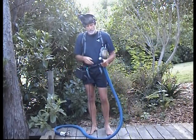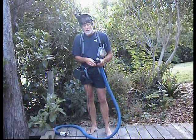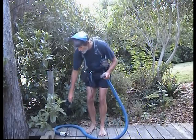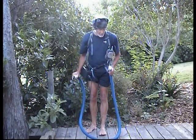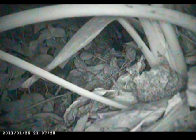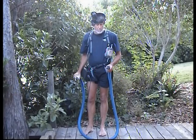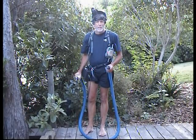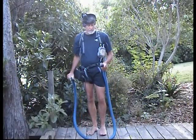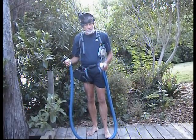As this is a colour camera, when inspecting burrows under infrared light we may see an animal with a tag or a colour mark on it, such as plastic colour bands, to identify the individual. If we push the button you'll see three white LEDs produce a small amount of light so we can get a colour image and understand the colour combination on the animal. Under infrared light the image has no colour — it's essentially shades of grey — so the white light is necessary, and there's only a momentary switch which actuates it so it can't be left on.